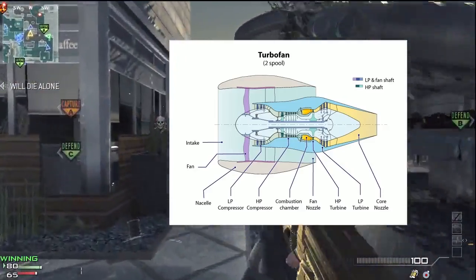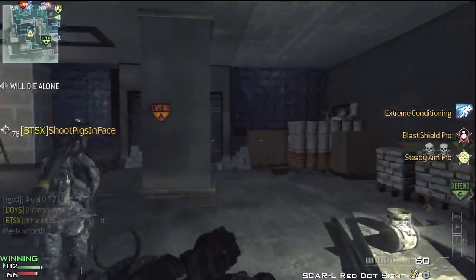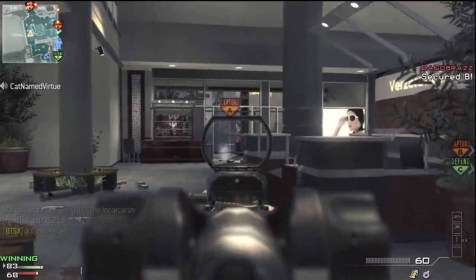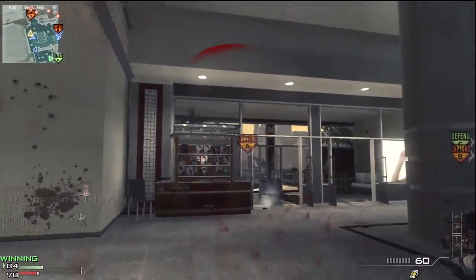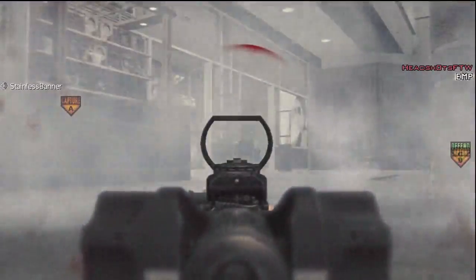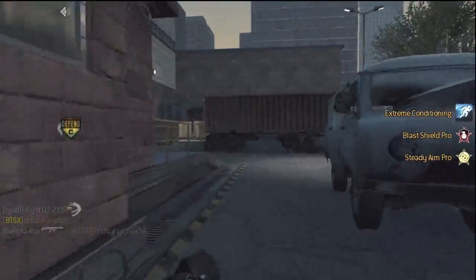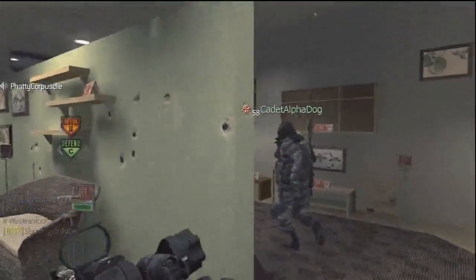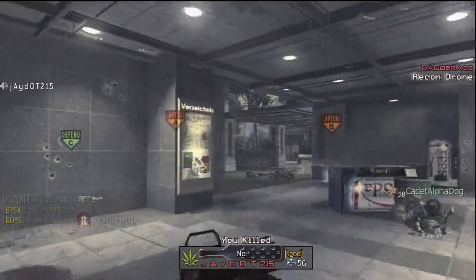Compressor cases are similar to the turbine cases we're going to discuss later on, and they're basically a series of discs with blades attached. The blades are actually shaped like the Nike swoosh logo, if you're looking straight down at one. And this forms the air, it compresses it, and it pushes it on forward because the engine's moving forward. More air is coming in at all times, and it pushes it from the low compressor into the high compressor, and the high compressor compresses it even more, and it pushes it into the diffuser case.